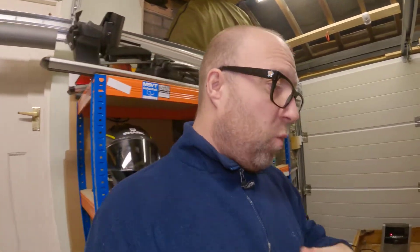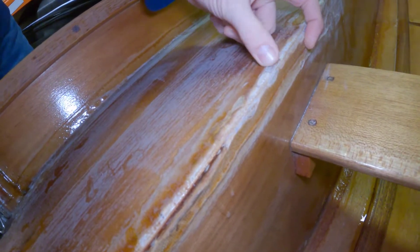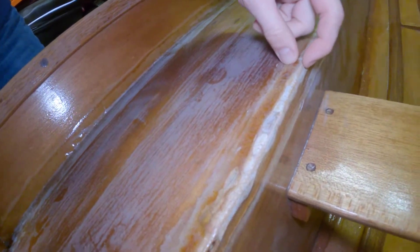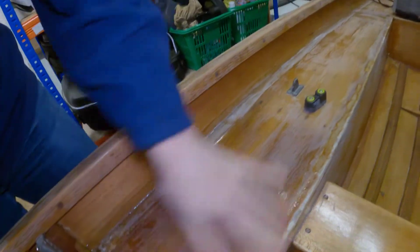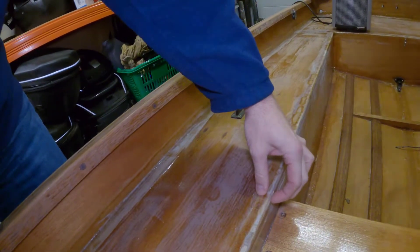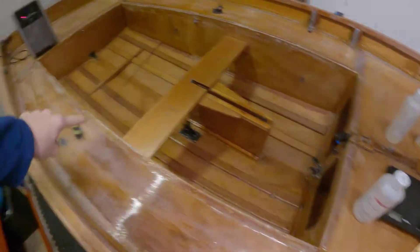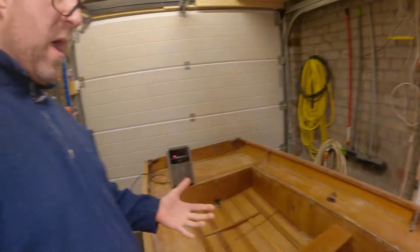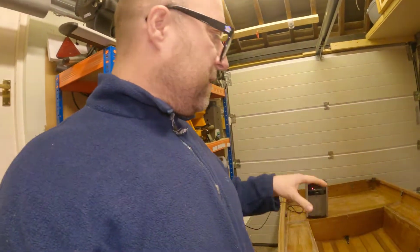The trick now will be — I've just got to wait for my little craft bottles with needles on them. The idea is to get inside these little bits that are moving about. You can see the tape has basically split there. Ideally you'd want to strip this all down and retape it, but I'm going to see if I can get away with just epoxying it over and under and inside. If we can get through a season that way, all the better. It's literally only those two tapes — the rest of the boat is really sound. So really looking forward to finishing the epoxying and seeing if we can get it all shored up.